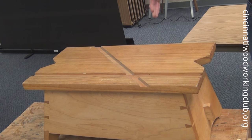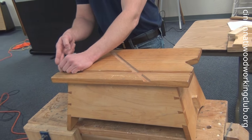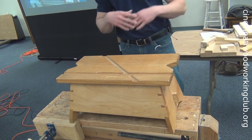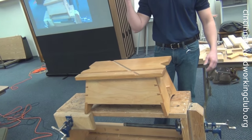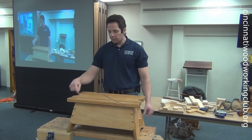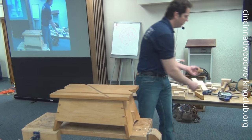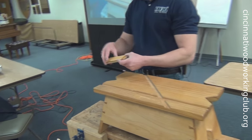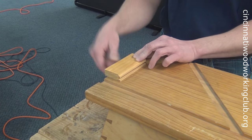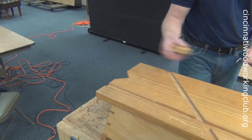These grooves on it are very handy — I do a lot of quarter round and shoe mold, so I can set this right in the middle of the room and make my straight cuts, my miter cuts. I can trim out the whole room without running back out to where the miter saw is. And the little slot cut here — if I have a small piece of wood and I want to drill a hole in it, instead of hanging it over the edge, I just place it right over that V-slot and drill right down. Now I have support on both sides.